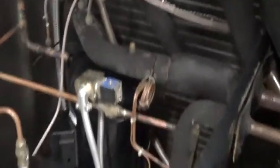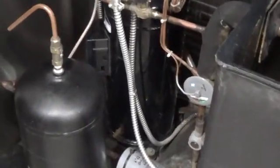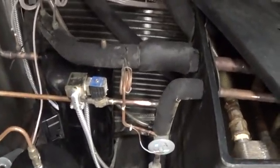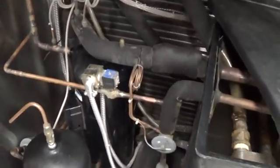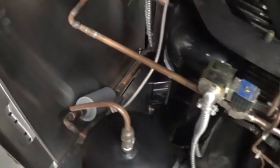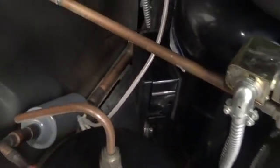Here you have your 10 horsepower Copeland scroll compressor, your refrigerant receiver, your thermal expansion valve, your sight glass. You see a nice green center dot there. And you've got two solenoid valves here and here in the refrigerant circuit. One is for positive shutoff, the other is for hot gas bypass option or capacity control, which this does have. You have your refrigerant dryer here.